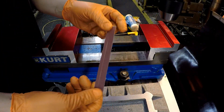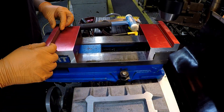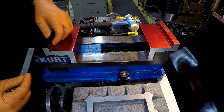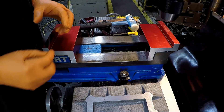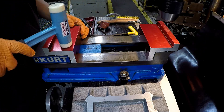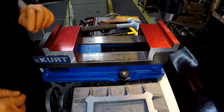I'm going to use these emery paper strips in between the workpiece and the jaw. That'll help create a little bit of extra grip and also protect this from getting gouged from the rough casting. I also want to point out to tap these things down so that they're square against the tops of the jaws once I snug them up.